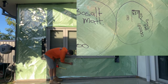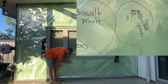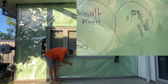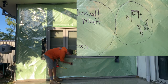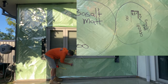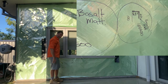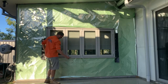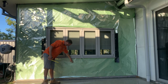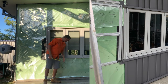and then squash fold again, so that if any water was to come into here, it's going to hit this part and it can't continue to come in. It's going to hit that and seep sideways or come back out again. Now this angle here, we do this at an 89 degree angle, and then we open this one up here and make that a 91 degree angle, making this 40. You might look at that and go, gee, that's a bit complex. But they can make it, and that enables this toe mold to go on first and give us this really nice waterproofing system that if any water was to come back in there, it's just going to hit that and then it's going to drip out. So that's what we're going to do along there.